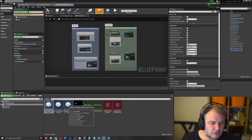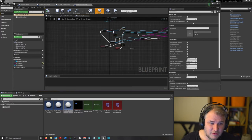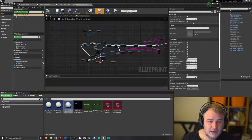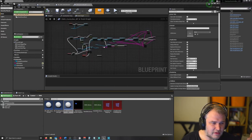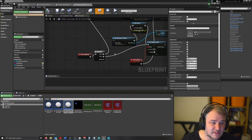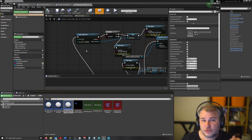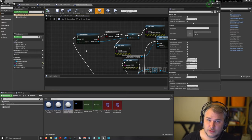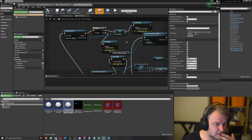But the ones that we do have is we've got this DMX controller, which is a little bit unorganized at the moment, and I need to go through and organize it. And it's got some legacy stuff, I think, somewhere in here, or maybe in another section. But the way that this works is obviously on begin play of the scene, it will open the port. And because we're using two different ESPs, we need two different ports and two different baud rates as well. So that just runs through the standard process of, if it's connected, it's connected. If it's not connected, it's going to tell us.